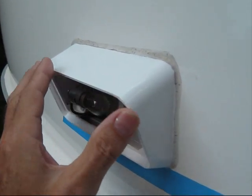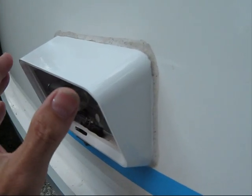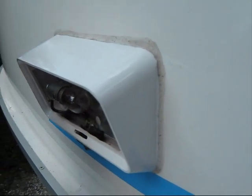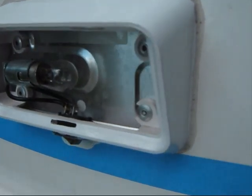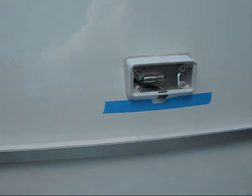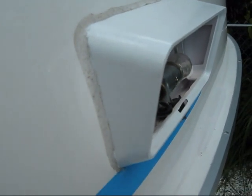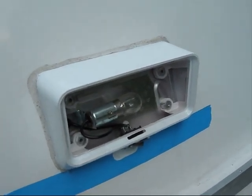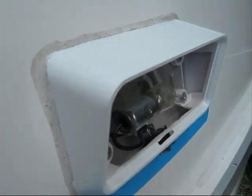We've put on a second coat and let it dry for a day. I'm really happy with the finish. I ended up using a soft sable brush about a half inch wide to do the second coat. It's got very good coverage with just two coats, so I really don't think it needs a third. The self-leveling properties of the Interlux Brightside polyurethane paint are very impressive — I challenge you to see a brush stroke in it. It's pretty much impossible, and it gives a very nice finish. Certainly a very nice remediation to the standard yellowing plastic that you have on your Casita.